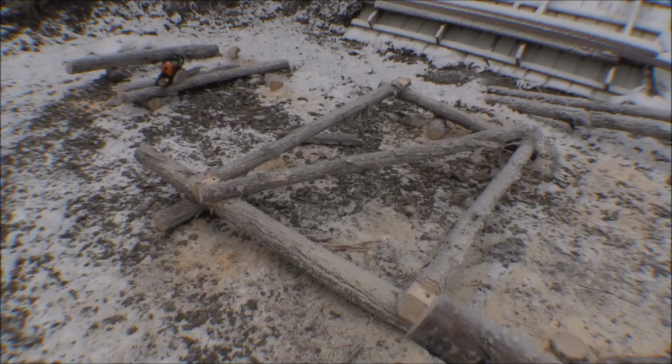But I got the saw there. I've started it up and got it running. It's 12 degrees out here so far this morning, and it's a good idea to leave that saw idle and run so that the chain oil loosens up on it, gets warmed up on it, and will help lubricate the chain.